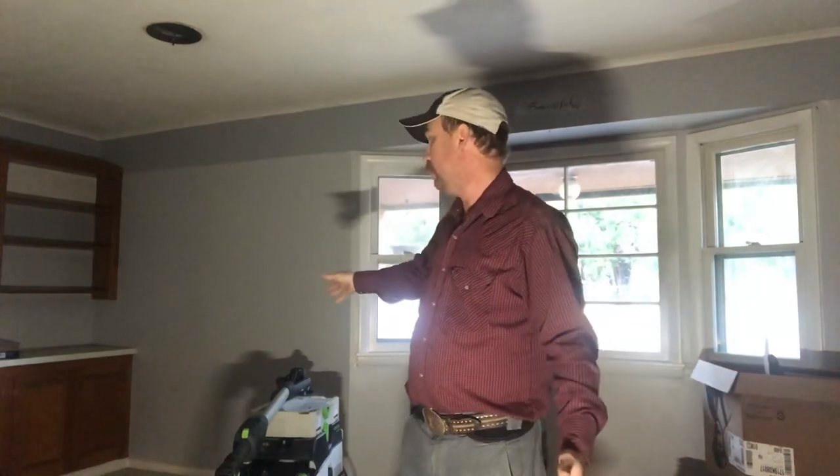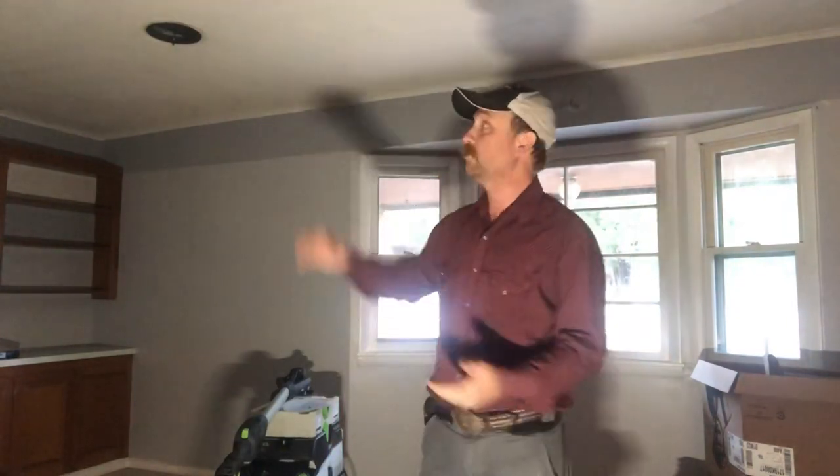This house is a full popcorn removal on a 1,600 square foot home, so it's going to take a minute. A room this size — around 12 by 20 — is taking me roughly an hour to remove the entire popcorn ceiling. And this is not going smooth; it's going to where the finish after you put flat paint on it will look like knockdown texture, like they do on new homes now. I think it's going to look amazing compared to all the shadows and dirt from the popcorn ceiling.